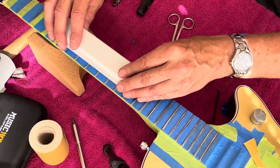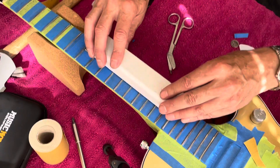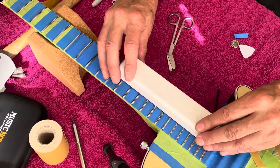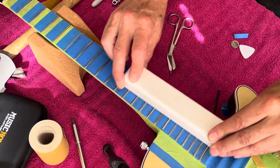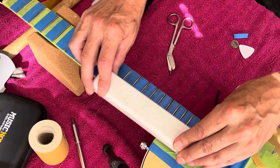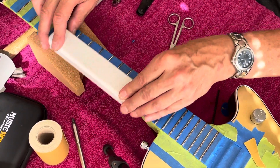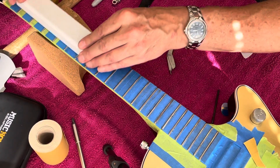I'm going to try not to work one spot too long — keep it moving. I can't believe how low some of these frets are, or how high I guess would be the better term. I want to make sure I keep parallel to the side of the neck. Just because one section looks done doesn't mean you stop there — you need to keep hitting everything evenly, otherwise you'll leave those spots high.